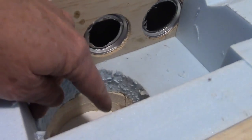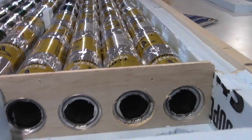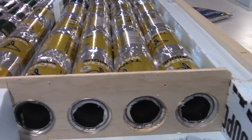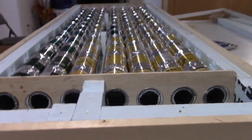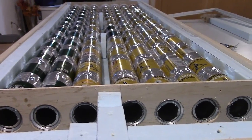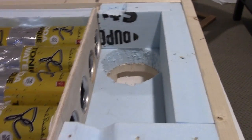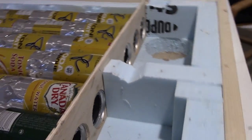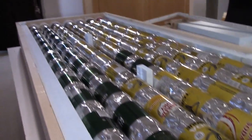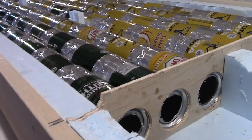For the input side, there's a hole where the ductwork is going to come in. I've got 3 on the input side and 4 on the output side. The width of my glass could have allowed 6 or 7, so I just went with 7. I've put styrofoam insulation all the way around — inch and a half on the bottom, the sides are covered — and there's styrofoam insulation between my input and output side just to keep those separate. I've cut everything out nicely to line up with the edging for my window.